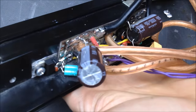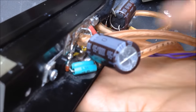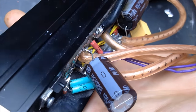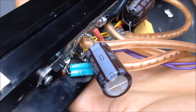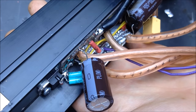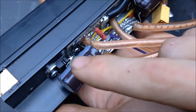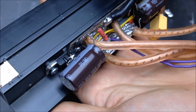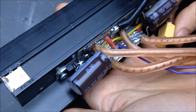With the resistors, it is important to note, I have about 1K of resistance on here, so two 2.5Ks in parallel together. You can see that. And that is because I was running this at a much higher voltage. I was running this at the 16 volt range, which you want to have higher wattage and higher resistance resistors on, just because of the amount of power that you're going to be moving between your diodes and your on resistors. So, of course, the more voltage you put into your system, the more voltage is going to come off the drain and go through the diode and fight against your on resistors. Of course, the more it fights with the higher voltage, the more current, and the more heat it's going to generate as that goes up.